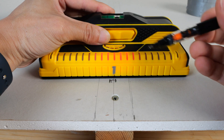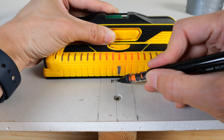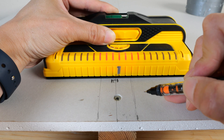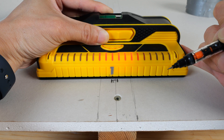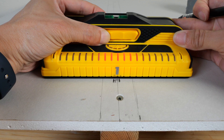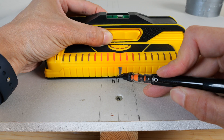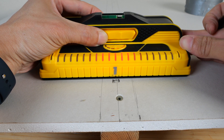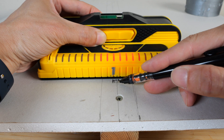What you can do to improve the accuracy: move it all the way to the right until it changes. Because I know where the center of this stud is, I can just mark it right here with the pencil. And then go the other way until it changes, right there, and then mark the center again. So now whenever I use it, I can just move it until it changes, and then this marker will tell me where the center is. I can also do it to the other side — right there. This marker says the center is right here.